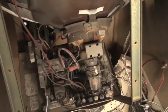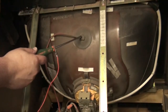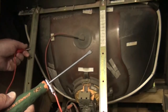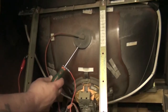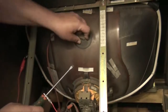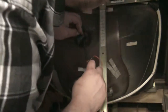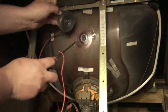I'm going to get the tripod set up and we'll pull this chassis out. First things first, we have to discharge the CRT — the second anode right here. What I've done is I got a regular screwdriver with an alligator clip. I'm going to clip that to the frame of the monitor, sneak this thing underneath there, and you'll hear a little pop.